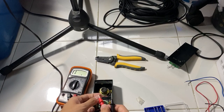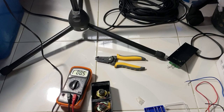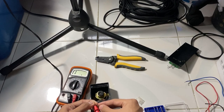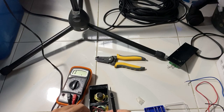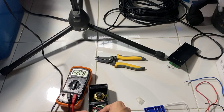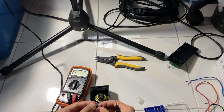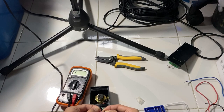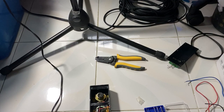We're gonna be connecting it to test. There's no impedance reading at first — let's connect it again. They are 8 ohms — you can see it's an 8 ohm speaker, so we could wire them in parallel. You just need to be very careful so you don't fry them. I don't get any reading on the second one but I think it's also 8 ohms. Furthermore, we're gonna be connecting them in series because these things could get fried easily if we haven't taken that into account.